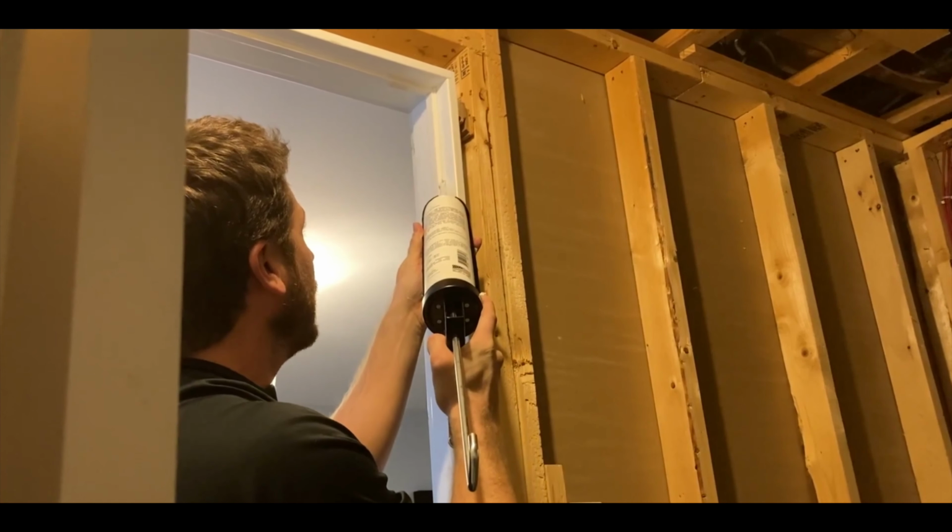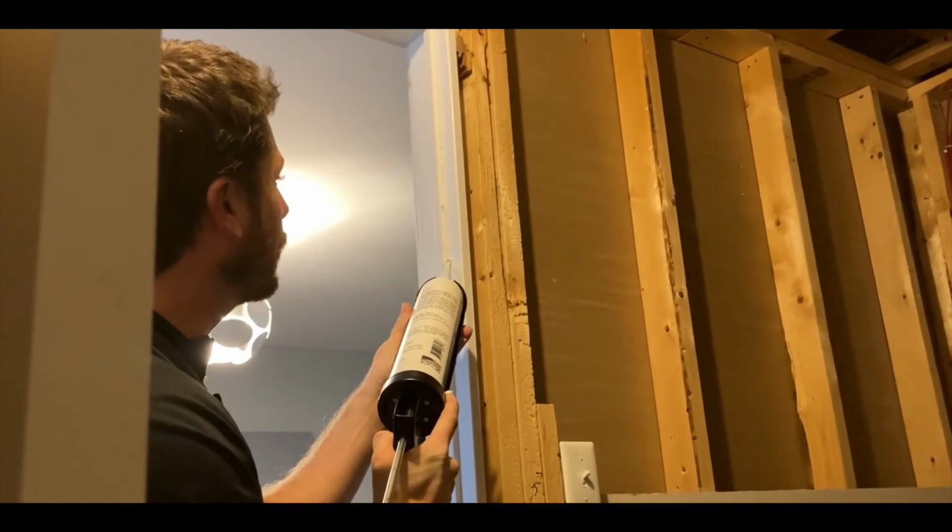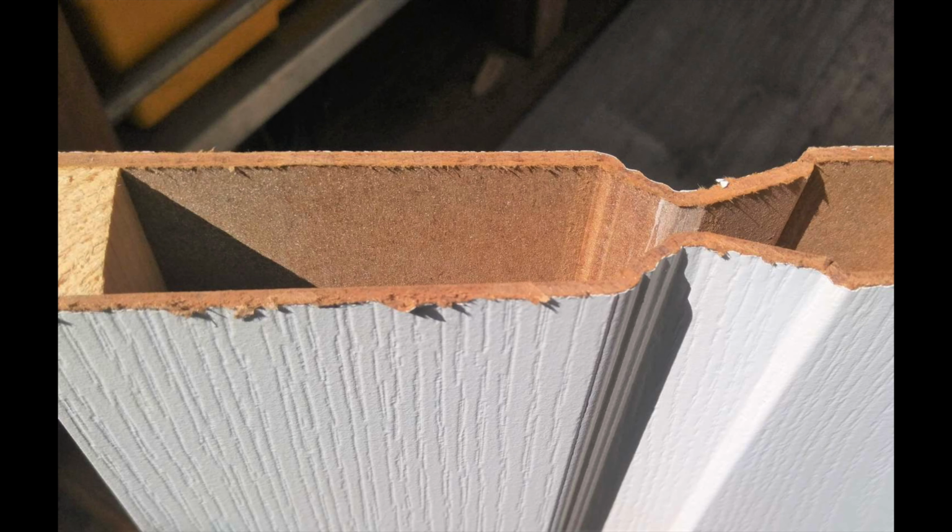Now the door, usually you would just seal around the door and at the bottom, but since you're trying to drown out a lot more noise, you'll need to completely replace the door, because usually inside a home you would have a hollow core door. To know the difference, all you need to do is knock on the door. If it feels hollow, it's a hollow core door, and if it feels solid, it's most likely a solid core door.